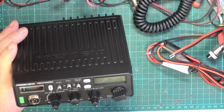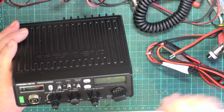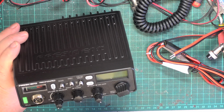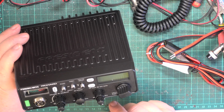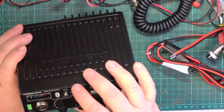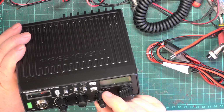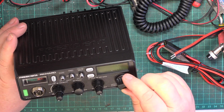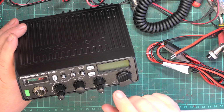It's got a traditional meter, which hopefully lasts longer than the meters on those Midland 48s we've been having a lot of. You've got a 5 volt USB outlet to charge whatever. I hope the Echo isn't part of the set. That would be frustrating. So what would be a channel 9 switch is emergency 1 and emergency 2, which is programmable therefore. Concentric RF gain and mic gain. It won't be a real rotary switch, it'll be just an up-down rotary encoder, then push to access something menu-wise.